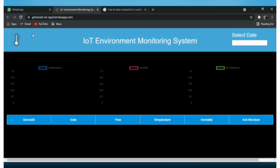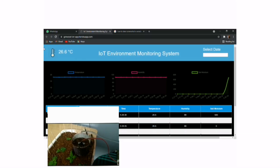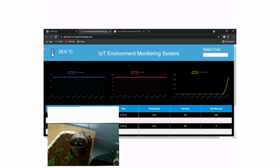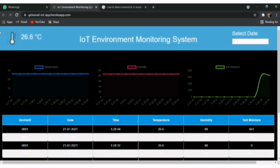There will be only a slight variation in the values of temperature and humidity — they remain relatively constant. Currently, the soil moisture sensor is dipped into dry soil, so the value of soil moisture is 0. The threshold value is set to 500. When the circuit is connected to power supply, the valve turns on automatically because the soil moisture is below 500. The water flow will stop only when the soil moisture value exceeds 500.